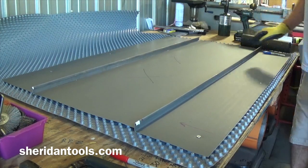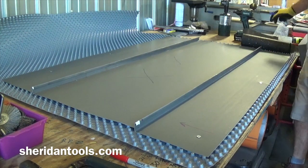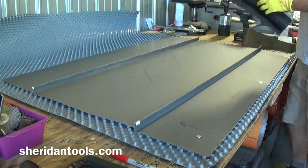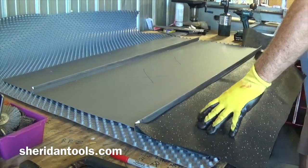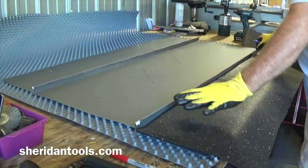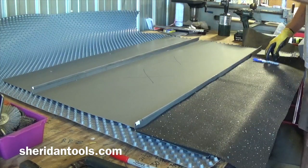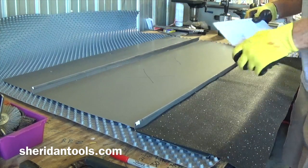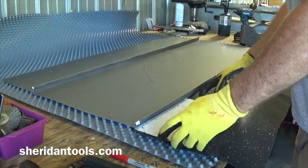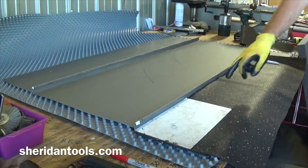So for preparation, you want to get everything ready to go. I'm going to take my shelf paper, put it along my seam here so that my roof is protected. That's not enough to protect tool marks. So always use a piece of heavy gauge material to keep tool marks from transferring through to the panel underneath.